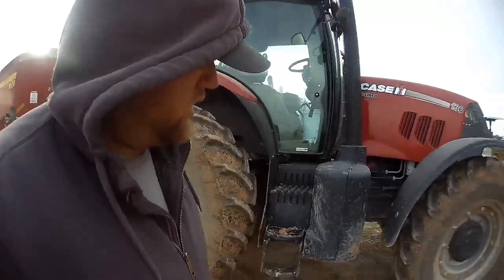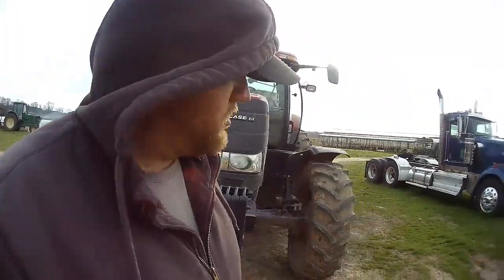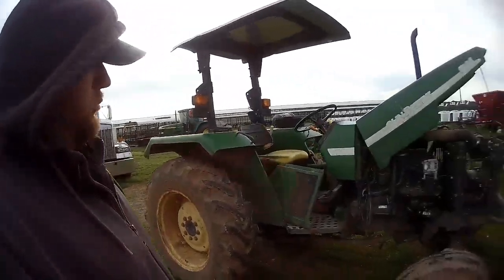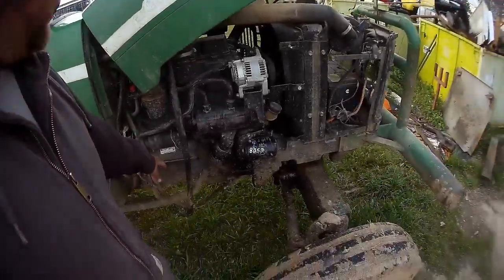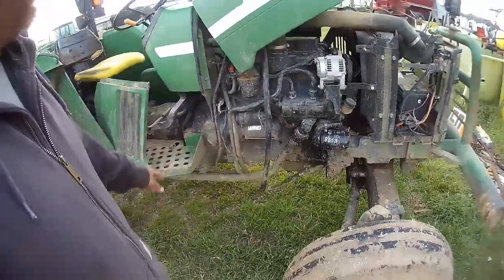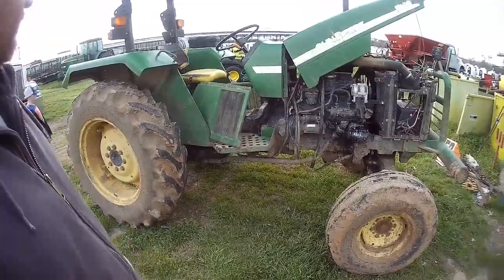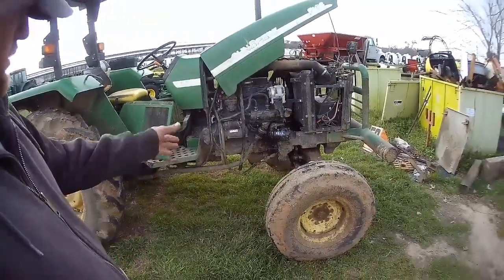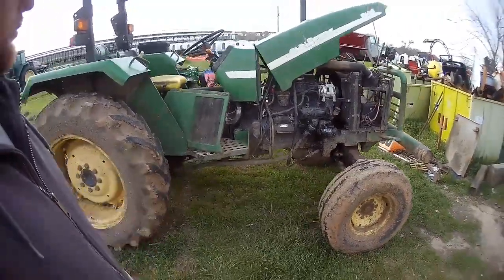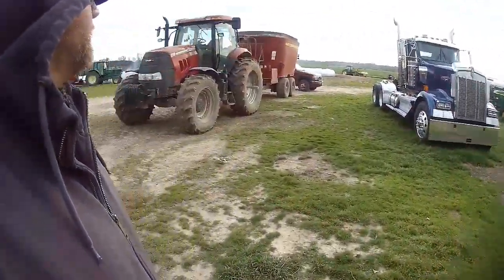May also drain the water out of the water separator on this tractor. It's been flashing at me saying it's got water in the fuel. So we'll get that done and we'll check back. This is the cow pushing tractor. We got a starter ordered. It should be here Tuesday or Wednesday. So right now it's kind of a pain in the butt getting the cows up, but I got no choice. This is about the only tractor those guys can drive without tearing it up. So we'll have to replace the starter here in a couple days. Today's Saturday, so Tuesday, Wednesday, yeah, whatever. Hopefully it shows up Tuesday.